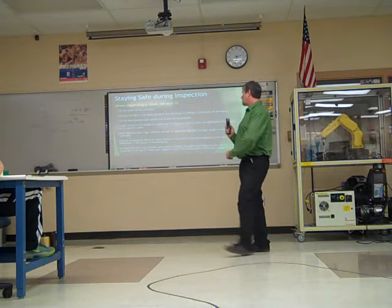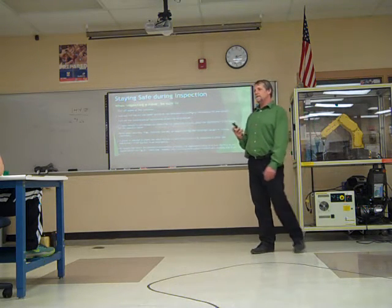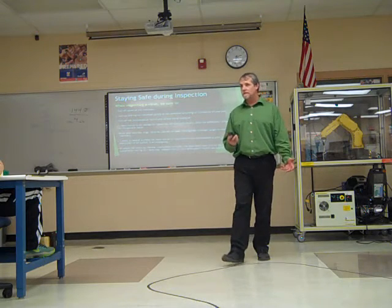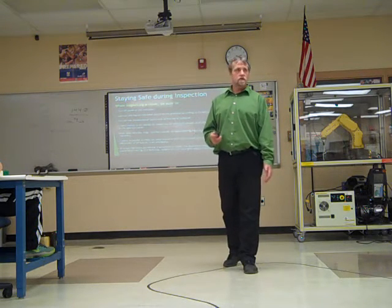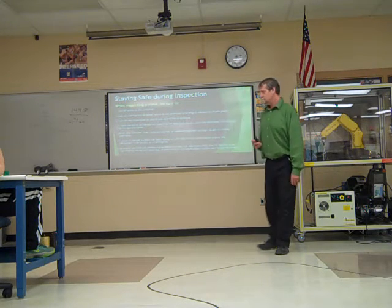If power is needed to check the robot motion or electrical circuits, you should have an e-stop close to you. Have the teach pendant there. It's got an e-stop on it. Know where your closest e-stop is in case you have to push it.